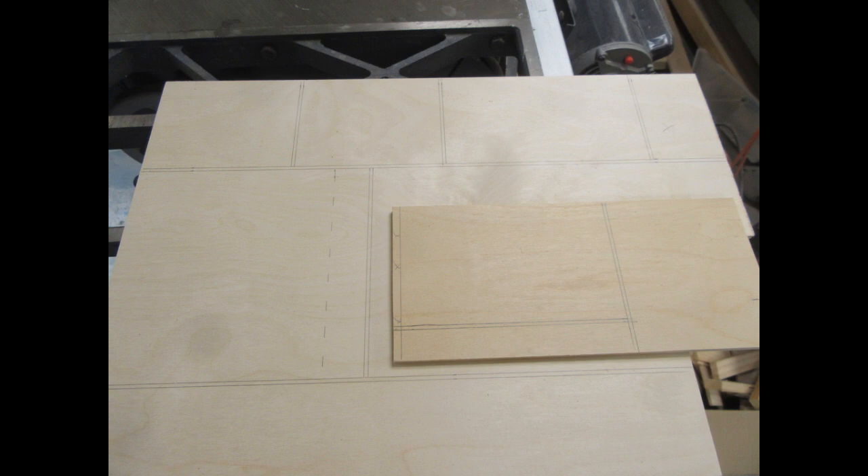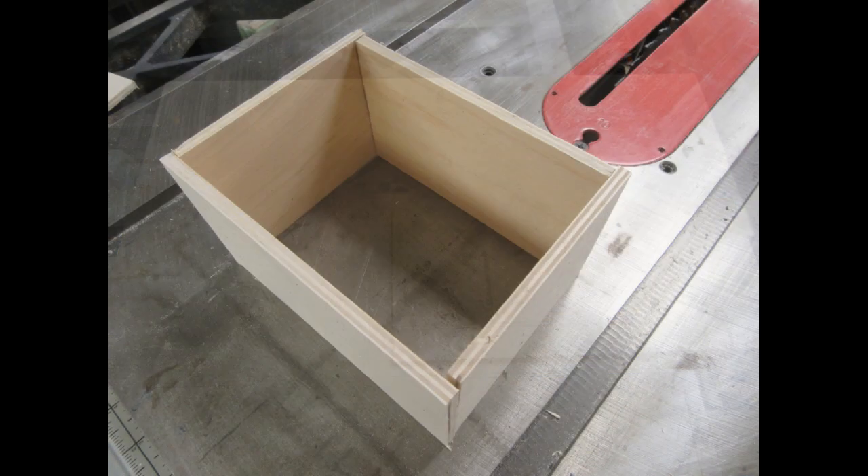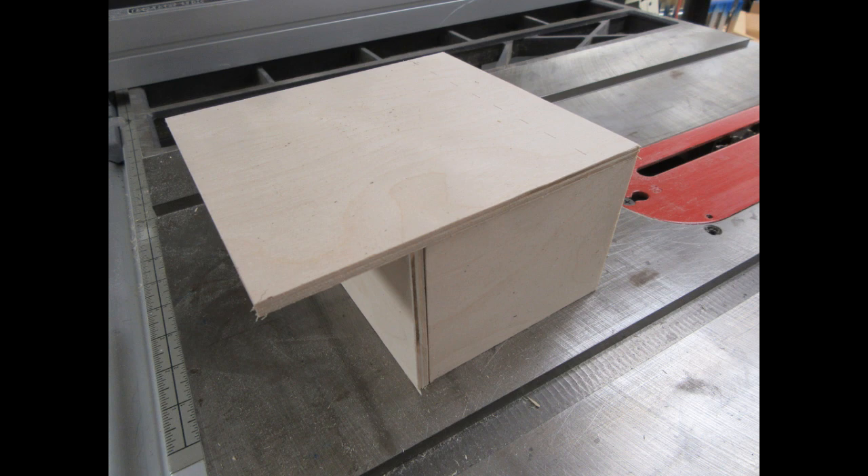All of my cases have a boxette inside to hold a mouthpiece, valve oil, slide grease, and that type of thing. I use some leftover quarter-inch craft plywood — here I've marked all the pieces for cutting. I do a test fit of the pieces, and notice how the lid overhangs quite a bit. That's because a feature of my case is that the boxette cannot physically come open while the horn is in the case. This way there's no chance in transit of the heavy mouthpiece coming out and knocking around. If a box is held shut with a latch or Velcro or something, there's still a fair chance that especially with rough handling the mouthpiece will escape. So by having part of the cover of the case fit under the instrument when it's in the case, it prevents that eventuality from happening.